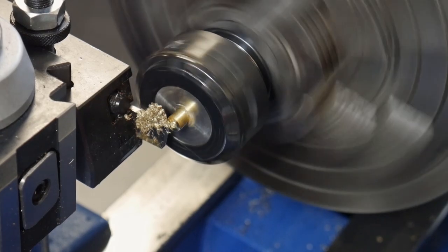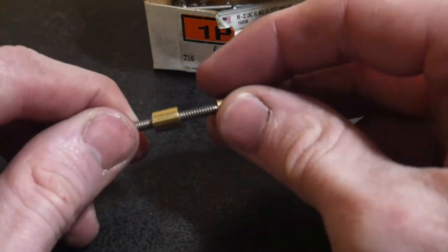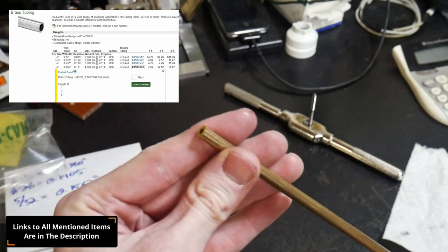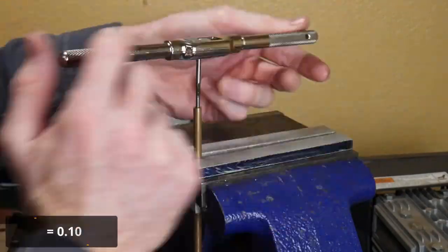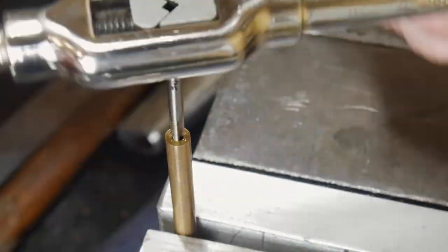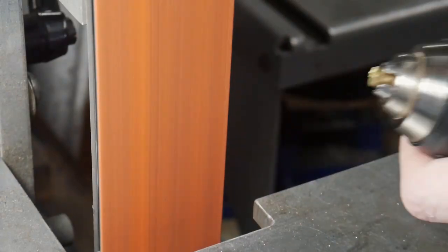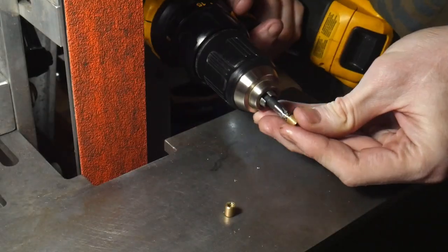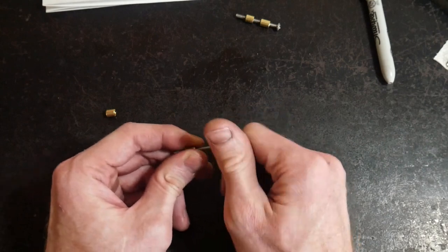Now we're going to cover how to make nuts for your Loveless fasteners without the use of a lathe. I found this piece of brass tubing from McMaster that has an internal diameter of 120 thousandths. This is larger than the hole produced by a number 36 bit, but you're still able to cut threads into it with a 6-32 tap — these threads will be around half the depth of what they would have been with the appropriate bit. My biggest concern with this reduced thread depth is not loss in strength but aesthetics — a larger gap between the bolt and nut. I use both of these Loveless fasteners on the knife at the end of this video, so you can tell me if you see the difference.